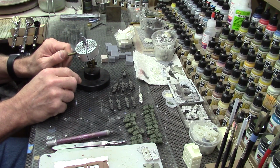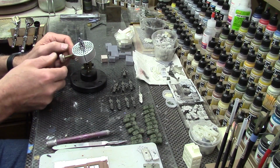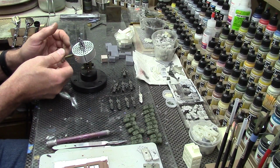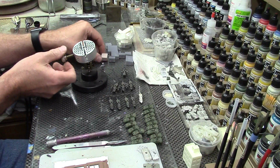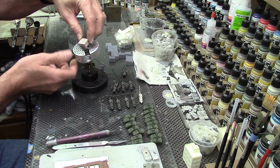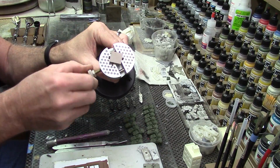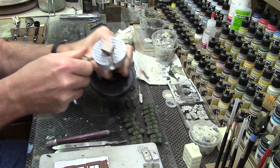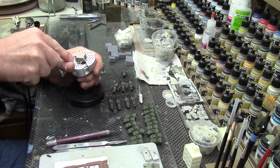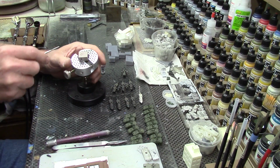What this allows you to do is clamp some very unusually shaped items that you couldn't clamp between two parallel vise jaws. If you have a piece of material that's squarish, without even moving these pins, I can just drop it right in there and close that up nice and tight, and that is in there really good. Now you can take one of your engraving tools or whatever and you can go in there and start working on that part.